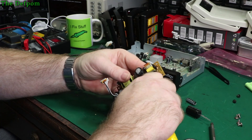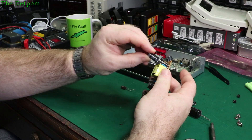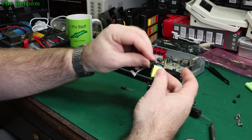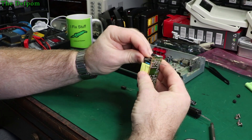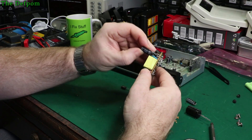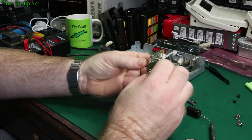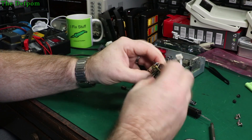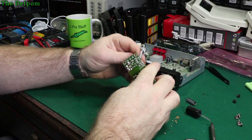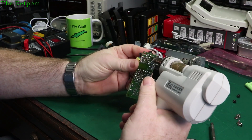That's that off there. I've got this capacitor to take out anyway, so I'll cut through here. Quite nasty stuff this glue - gets everywhere. It's obviously there to serve a function, but to me, eating through the circuitry after 10 years is probably not the best thing. I'd rather just try and remove it. This isn't too bad - sometimes it's really quite hard to get off. Right, let's put a cap in. It says there are two holes here for pin spacing which is interesting. That fits better, okay. So that's that one done - let's move on to the next one. I'll test these caps once I've got them out.